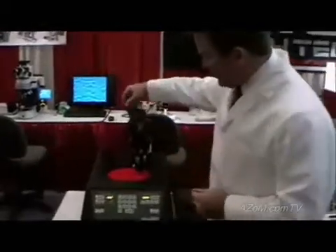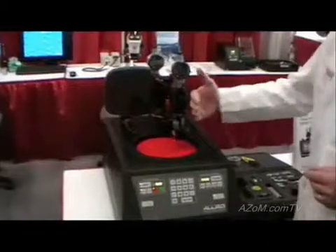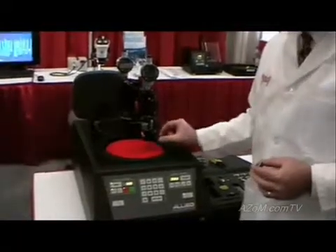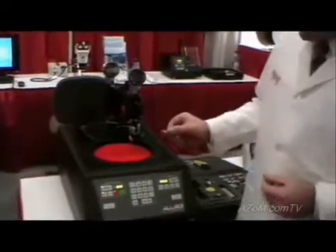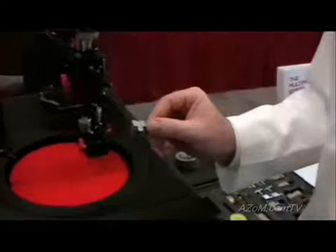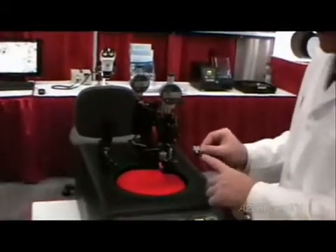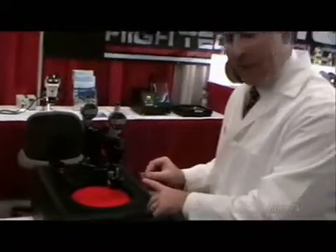The mechanism consists of a mechanical arm that supports a free-floating spindle, which controls the advancement of the sample into the abrasive plane. The sample is mounted to a fixture, and there are many different types of fixtures for adjusting the orientation of a sample. In this case this would be a cross-sectioning fixture, and this particular one features a Pyrex insert which is useful for TEM sample preparation.